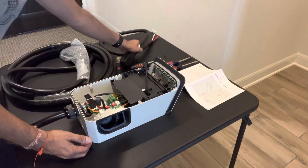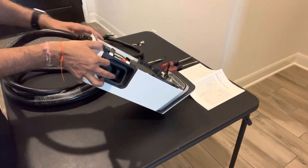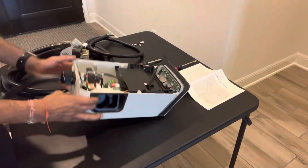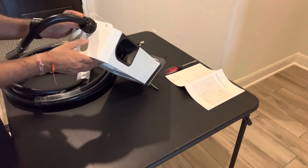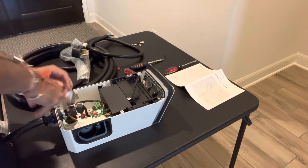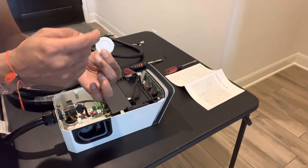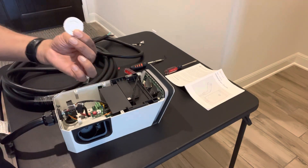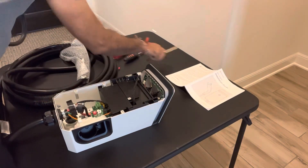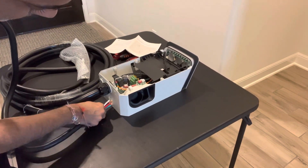Next, you need to get your wire into the charger. The Rivian wall box charger has a punch-out hole on the bottom. Just use a screwdriver and a hammer to punch it out — I've already partially done it here. Push it in and work the rest out. You'll see it has score lines on it, so put your screwdriver on the wider circle and tap around it, not too hard, and it pops out pretty easily. Then feed your wires through that slot.